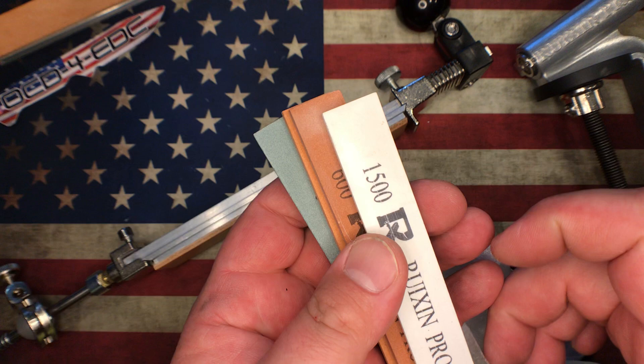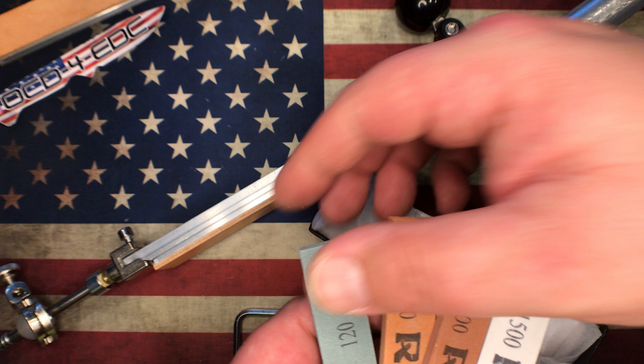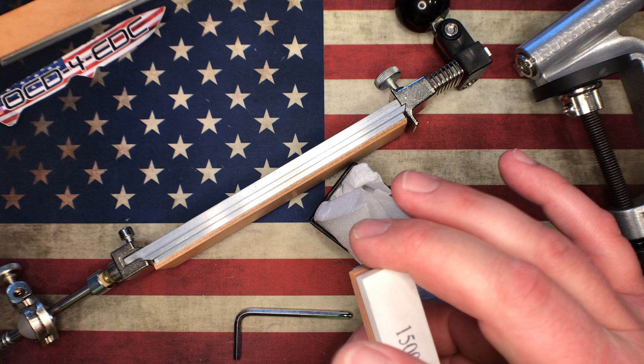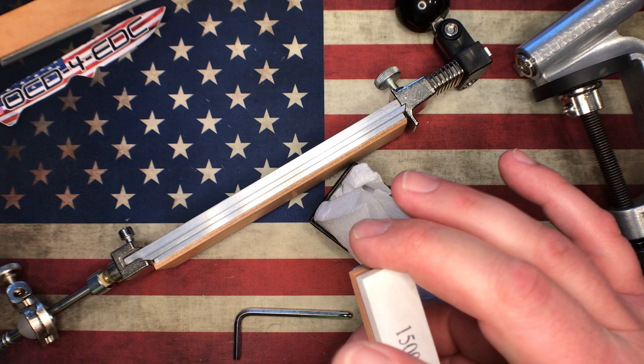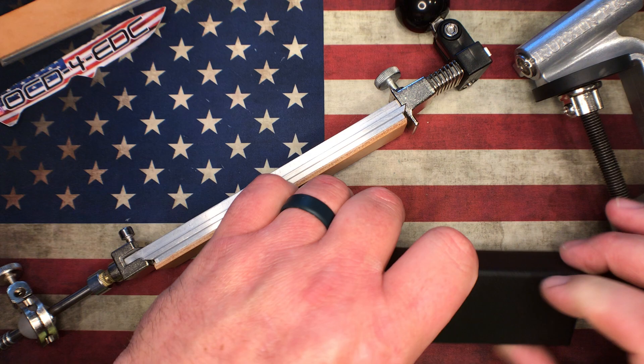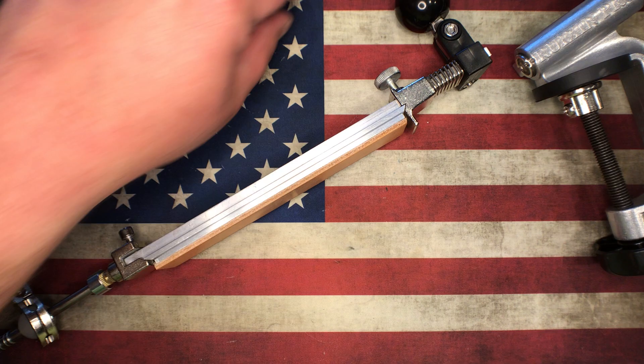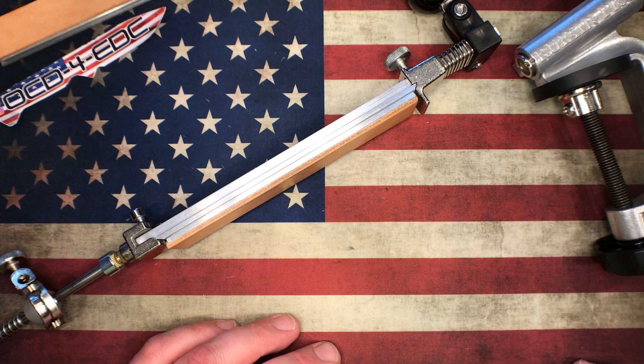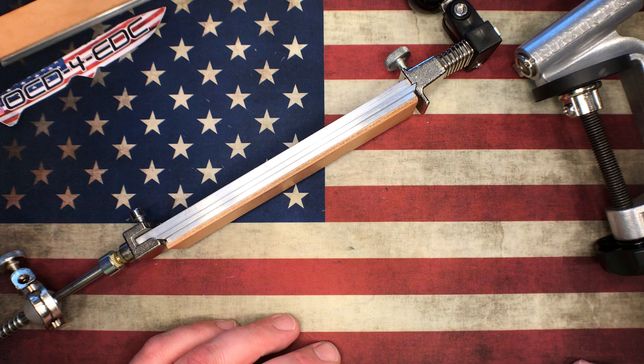This particular strop's leather is right at six inches in length, but the whole aluminum base is about six and a half inches. You can move the handle stop up on the aluminum bar to accept a four-inch long stone. These strops are right at one inch wide and they work extremely well. The unit ships with a 120, a 320, a 600, and a 1500 grit stone. You can also find countless additional stones online from retailers on Amazon, eBay, and elsewhere — natural stones, diamond stones, strops, lapping films.